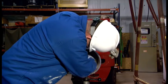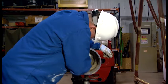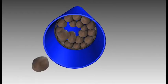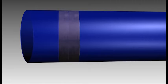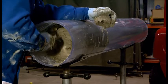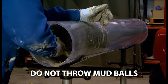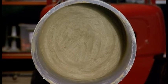At this point, use your hands to press the mud balls together and smooth the base into an even surface. Make sure the gaps are completely sealed and that the edges of the mud balls blend together. Continue the process building each ring using the same technique as building the base disc, ensuring all subsequent rings or discs are molded together until the desired length of the plug is reached. Extreme care should be taken not to deviate from this technique throughout mud plug construction, as the use of excessive pressure caused by throwing mud balls could compromise the integrity of the mud plug. The completed mud plug will look like this, sealed to the inner surface of the pipe with no cracks or gaps.